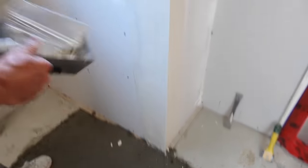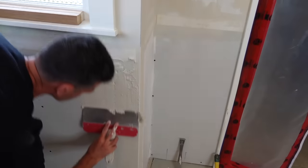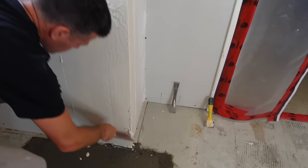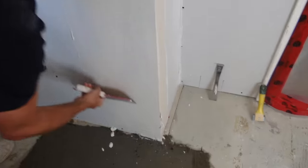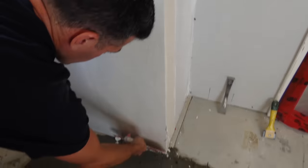Alright, that's a good start. We may as well see another coat on it. Now that I've got this tape, I'll quickly put another coat over top with this second batch of mud before it kicks off. Quick set is a wonderful thing — three-eighths inch, half-inch deep fills, doesn't matter, quick set can handle it. Or hot mud, as they call it in the states.